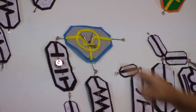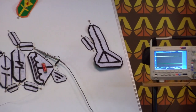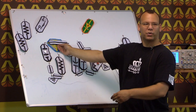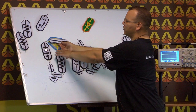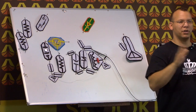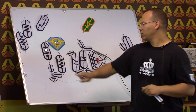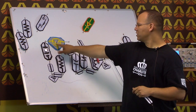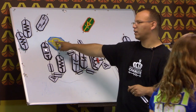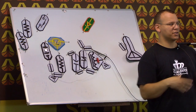And what I want is for this wire here to turn something on with the transistor. I want to turn my transistor into this, where it's just a short. And that's what I'm trying to get to. When I turn my transistor on, it becomes a short. And when I turn my transistor off, it's an open. No electricity passes, all right? And we control that through the base of the transistor. This little middle guy right here determines how easily electricity can flow. And when electricity flows easily, then the transistor's on or saturated.